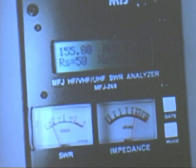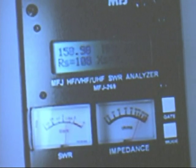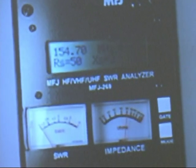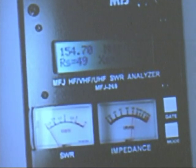I'm just watching the SWR — the frequency and the SWR. I'm just watching the SWR point, so I can just sweep this. There's a nice low SWR there.